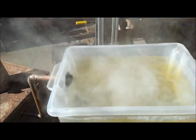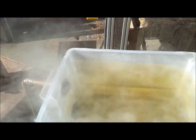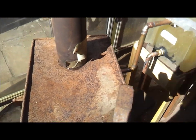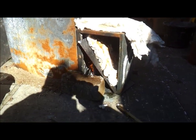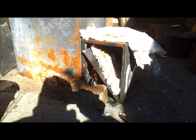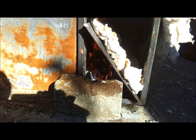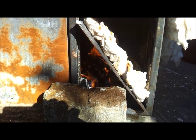I don't know what it's like inside this housing — it's maybe full of water down inside from the condensation from that wood. I guess in a proper stove that condensation would naturally evaporate out of the system. The firebox, as they say, sucks — but it doesn't suck enough. It's just bodged on the side there, hope and glory, hope it works sort of thing. But it's working, and I've had to just wedge that plate in because the opening was too big. Naturally the fire was wanting to vent out of the space rather than pull down the rocket chamber, but it's not a bad little draw on that rocket chamber.